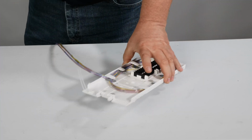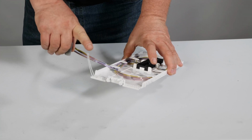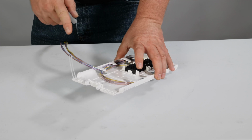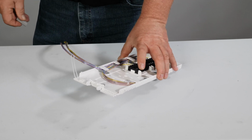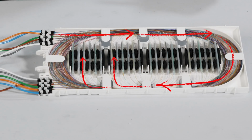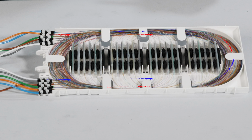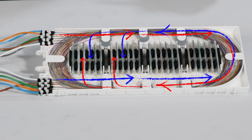When using the Apex Splice tray, it is easier to pre-install the supplied tie wraps prior to installing tube or foam retention. If all Splice modules need to be completely populated, it is recommended to plan the fiber route and Splice counter direction from each end. This applies to loose tube single, flat matrix ribbon, or Spiderweb ribbon fiber to prevent violation of minimum bend radius when splicing in the outer chips.